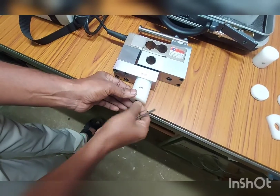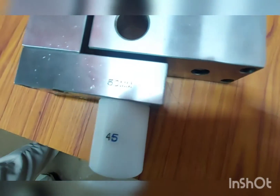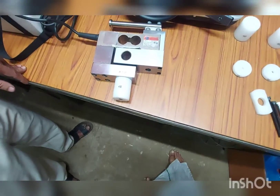The bottommost plate is already about 50 mm from the center, which means it covers 100 mm in diameter from the center. For any other increment — say 150 mm — you add a 25 mm spacer. If it is 200 mm, you put a 50 mm spacer. If it is 190 mm, you put a 45 mm spacer. That is the logic.